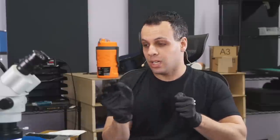I'm going over it with the iron and I'm doing mild scraping. Not harsh scraping, mild scraping. On an iPhone, much more mild scraping. But here, mild scraping. And if it's a power pad, I know that it's going to be attached to a very thick power plane. I know it's something where I can do a little bit more scraping.